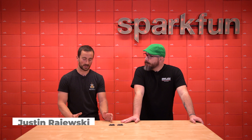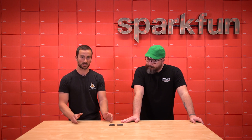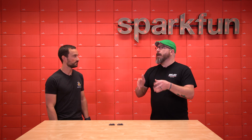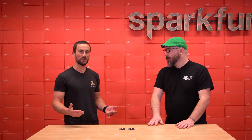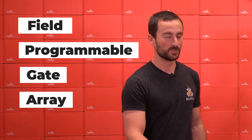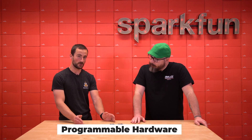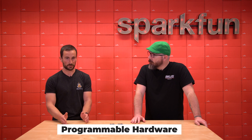The V2 system really represents an overhaul of not just the boards themselves, but also the software and new tutorials to go along with them. So for the uninitiated, what is FPGA? FPGA stands for Field Programmable Gate Array, but it's kind of a useless acronym if you don't already know what it means. What's most important is that they're programmable hardware, and that means you write something that looks like code, but is actually a hardware description language, not a programming language. And with that, you're describing a circuit, and the tools will take that description and figure out how to configure the FPGA to behave like that circuit.